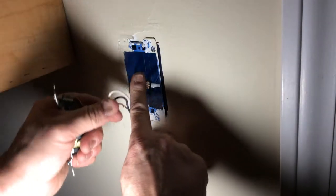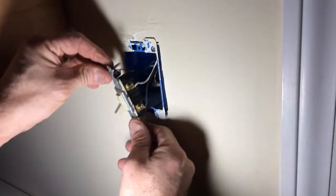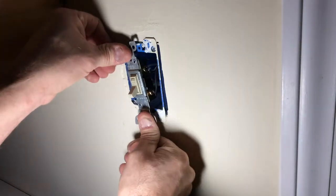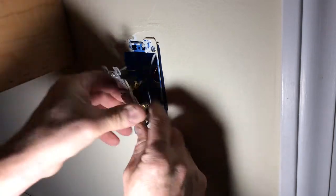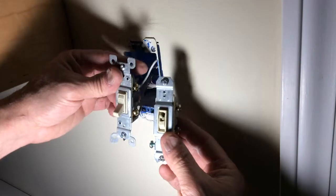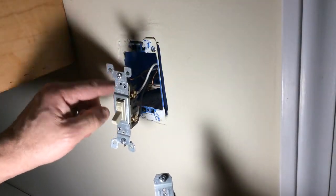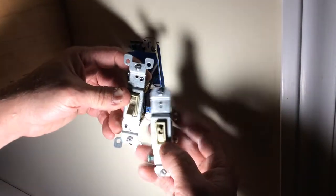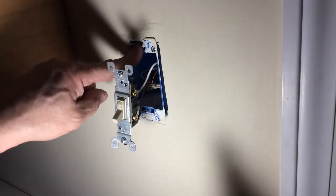So — 'off.' Then just taking the cord back inside here, I like to kind of push it in like that, pull it back out, make sure everything is okay. Now this switch here — you see this one still has the ears on it. That's because this switch box was cut in, so what I need to do is break these tabs off so it will set in on the box.